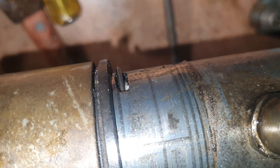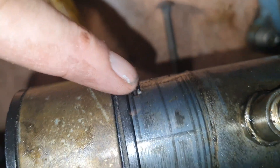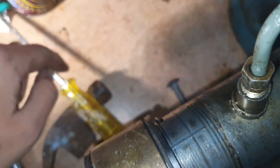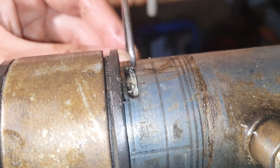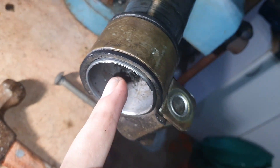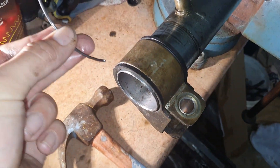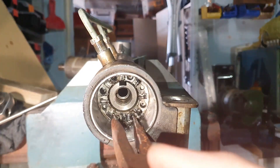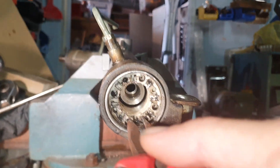This little pin here — as you can see I've got the tip of it. You could turn it actually a little bit further and then it hides away again. So I've turned it just so I can see the tip of it, then I managed to pull the tip of it out. And now I'm going to try and turn it anti-clockwise, and that should push this wire out of the hole and unlock it. As you can see it's coming out. The metal wire has this little tail on it that hooks in, so that little tail hooks in and then that would spin clockwise and tighten it in, and anti-clockwise to push it out. Alright, so now this little bit here should pull straight out.